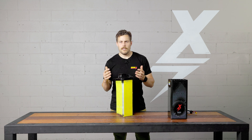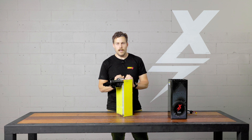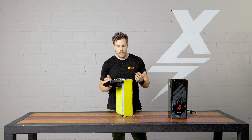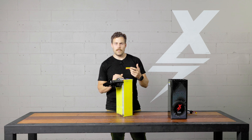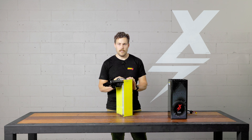The BMS on this battery is more powerful than we used to use, and we've also worked with the ANT BMS guys to develop some custom firmware — some special secret sauce — in these BMSs to communicate directly with some of the stock bikes' features. The Talaria battery can hook directly up and will show battery percentage on your Talaria bike if you're using the 60 volt battery. That can then be turned on or off depending on your control settings and how those communications work.